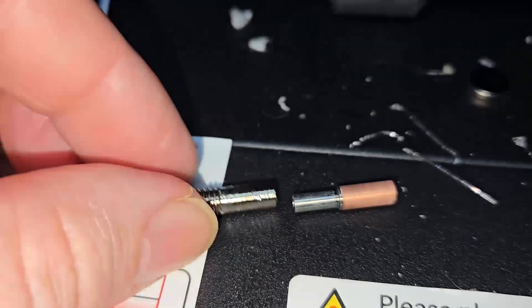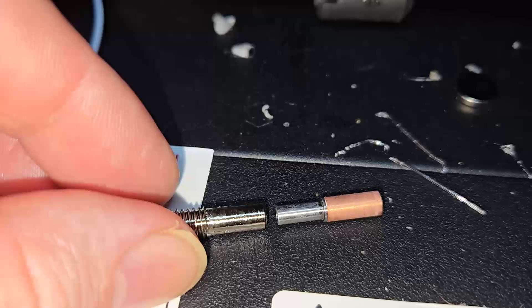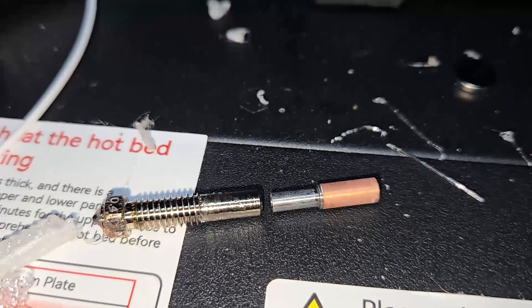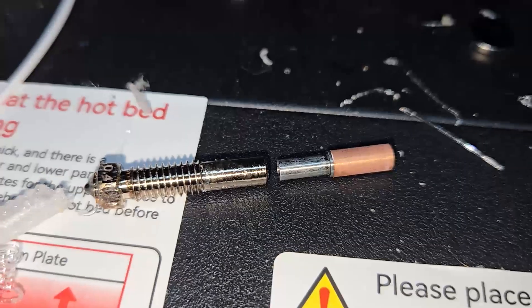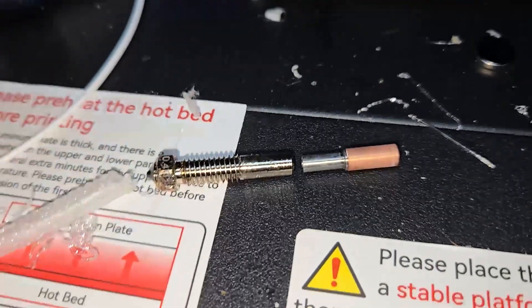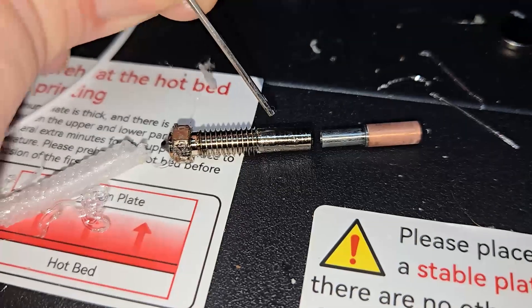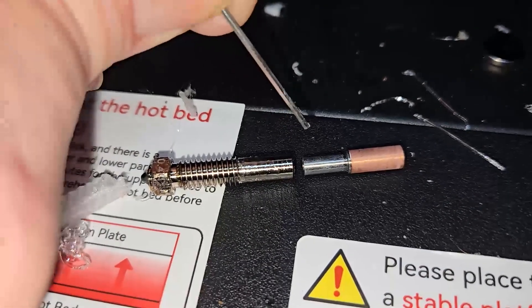The way these better heat-soak nozzles are built — see that gap there? Imagine that bridged with very fragile ceramic, and you get the idea. Is it superior for printing? Of course — the heat isolation is great. You've got this very hot part here, heat wants to travel up, gets to that ceramic bridge, and it's like it wants to go back the other way — it reflects the heat.